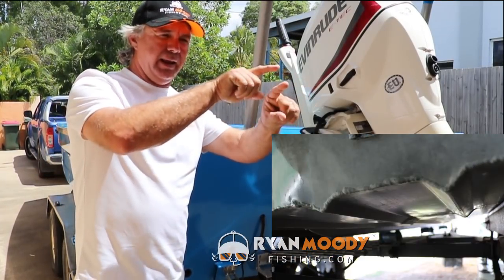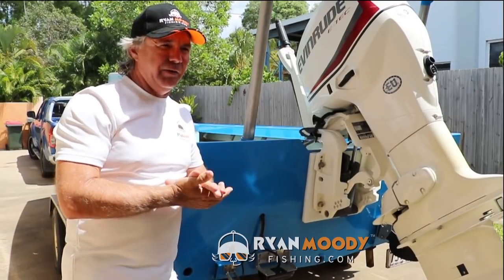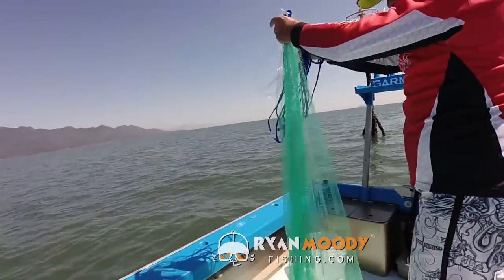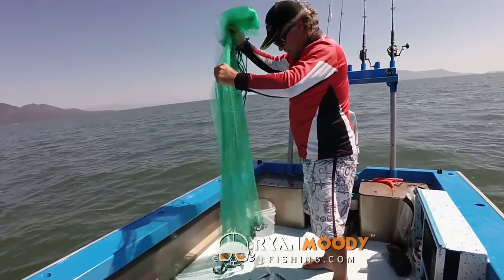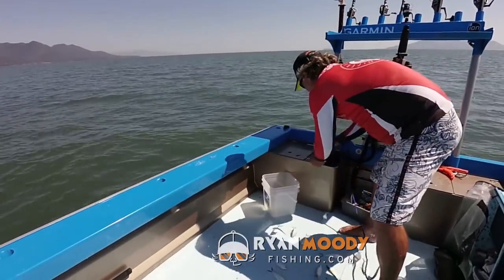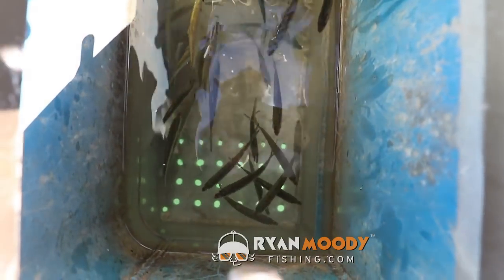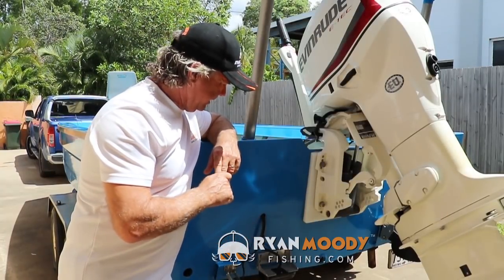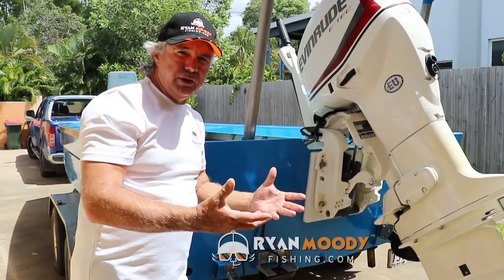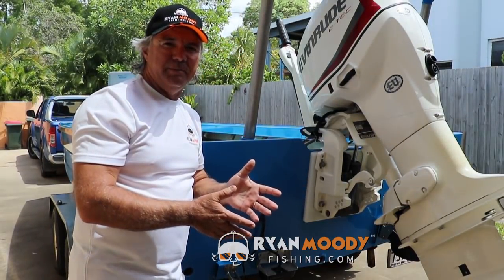I do know of a few people who've had these built into a boat with a pressed hull — they had to go to a boilermaker and get special bits cut out that slot down into the planing strakes. They seem to have gone okay; I haven't heard of their boat sinking yet. But if you're going to do it in a boat with a pressed hull, always consult a boilermaker first to make sure your aluminium is thick enough and that you cut the holes properly to sit down inside the planing strakes.